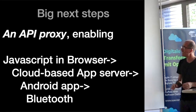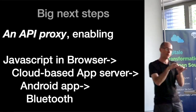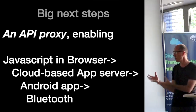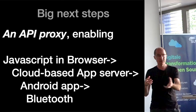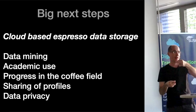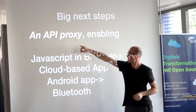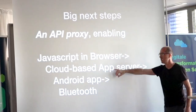Our big next steps: we're currently on Bluetooth. On the back of the machine is a little 8-pin socket using the Raspberry Pi standard for Bluetooth. The reason is the other thing that will go obsolete is Bluetooth — we're on Bluetooth 5 now, there'll be other communication mechanisms. In fact, the company that makes our Bluetooth module went bankrupt, but they were open source so we made our own PCB version of their thing. The intent with the hardware is you can change the tablet and you can change the communications mechanism and just buy something that works with the Raspberry Pi standard. What I'd like to do is a REST proxy that hides Bluetooth, so you could write JavaScript apps that talk to a cloud server that proxies to your espresso machine.